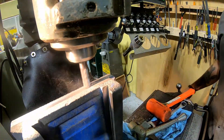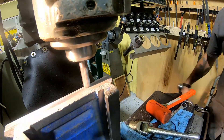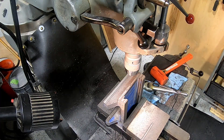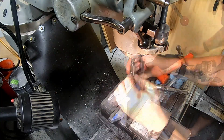The same thing here - there's a small flat for a measuring tape that fits on the other part of the cross slide for the left and right positioning. Then these are the holes for the depth rod, so I'm drilling those and then tapping them.